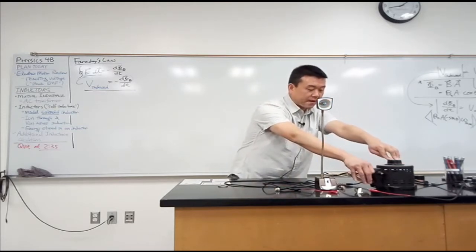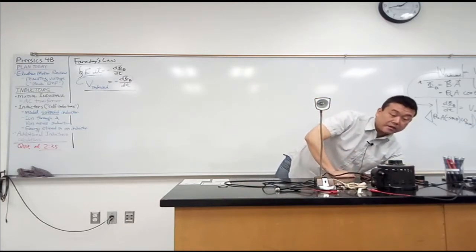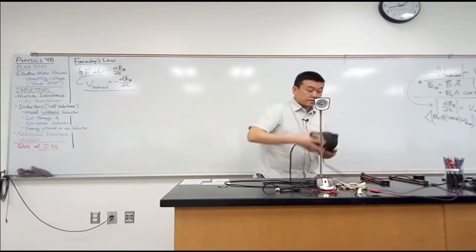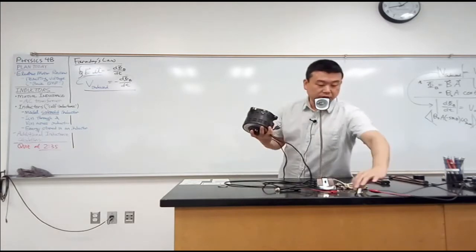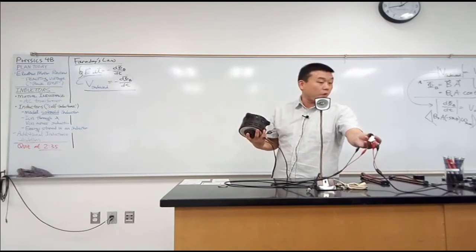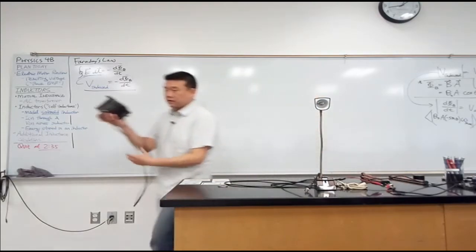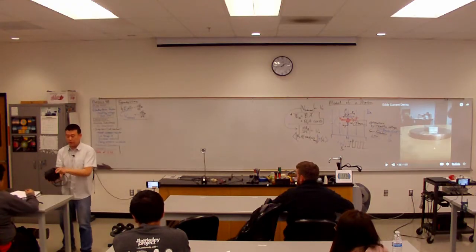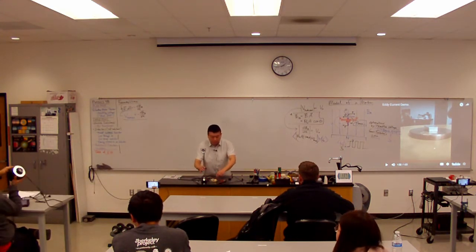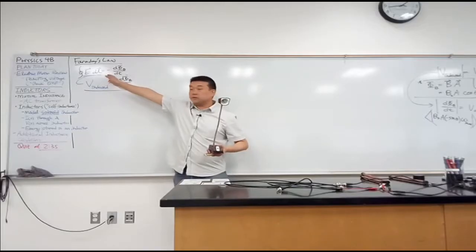Let me actually pass this around. What you will see is that it's a very simple device — it has no moving parts other than this knob. It has no sophisticated electronics. All it really is, is what you see here: two pieces of wire wound around a ferrite core. This is the Variac, or voltage transformer. It's a simple device because the principle on which it works is this single principle of Faraday's law.